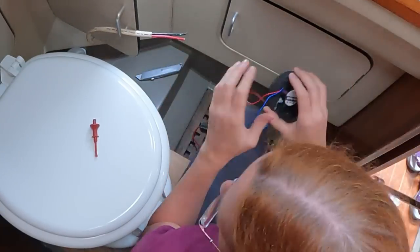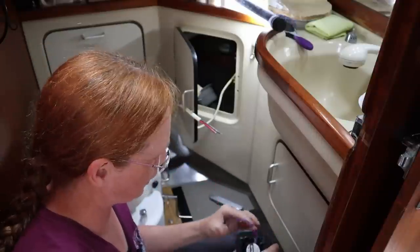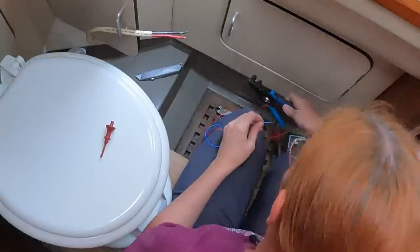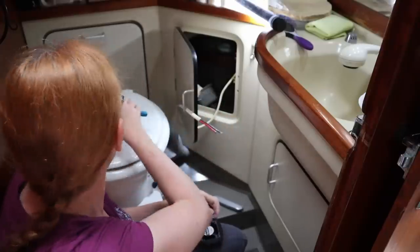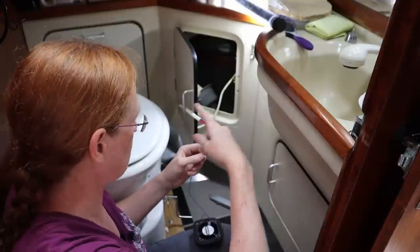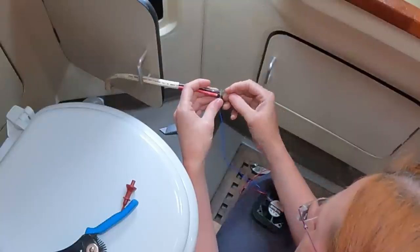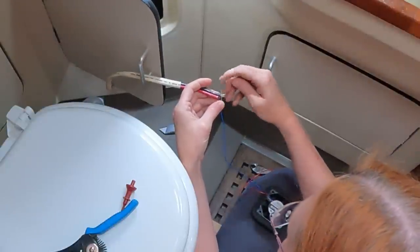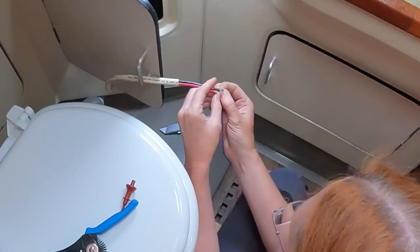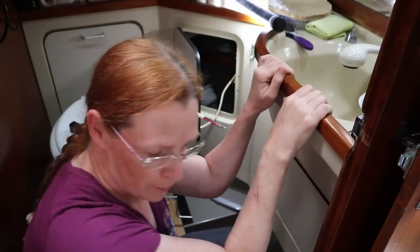You know, this is long enough with this. I'm just gonna put this straight on. It's ridiculous going from what, 20 gauge to 10 gauge. I'm gonna strip this back some more. And I'm going to treat this like a wire wrap. What I mean by a wire wrap is, it used to be a thing in computers where you would actually wrap a wire around a pin to create a connection. Well, can I actually kind of interleave this a little bit? Again, we're dealing with incredibly small... Oh, I gotta put some shrink tubing on there first.